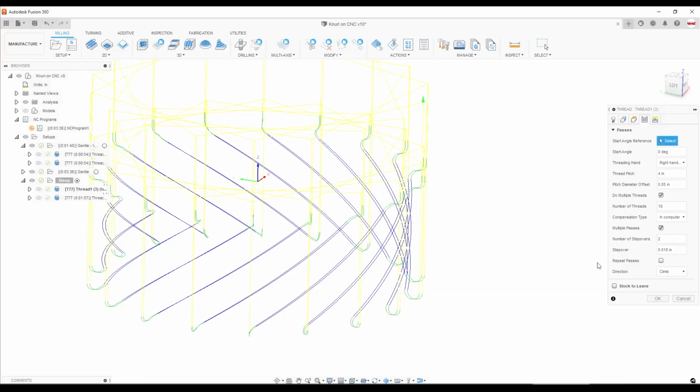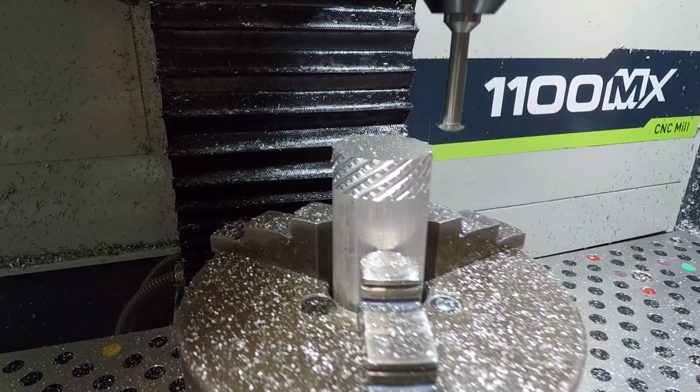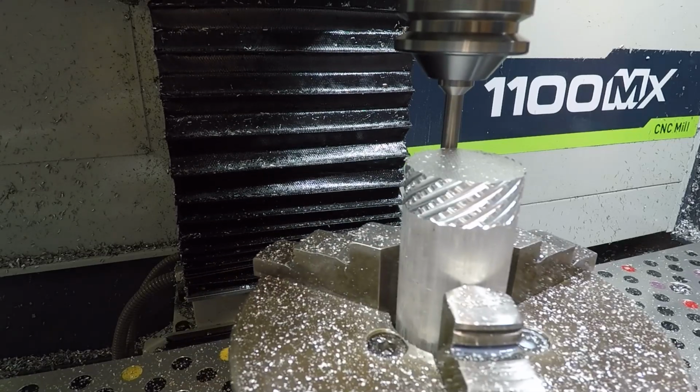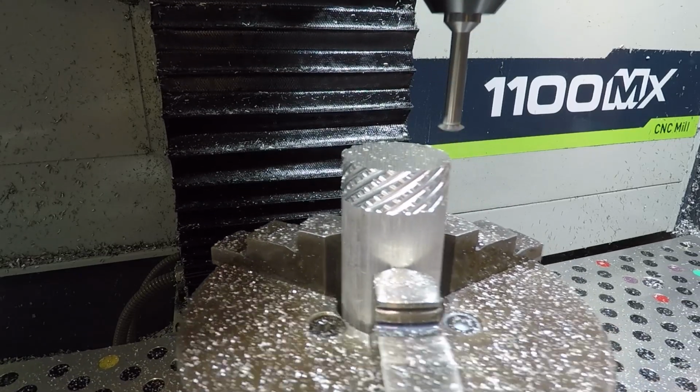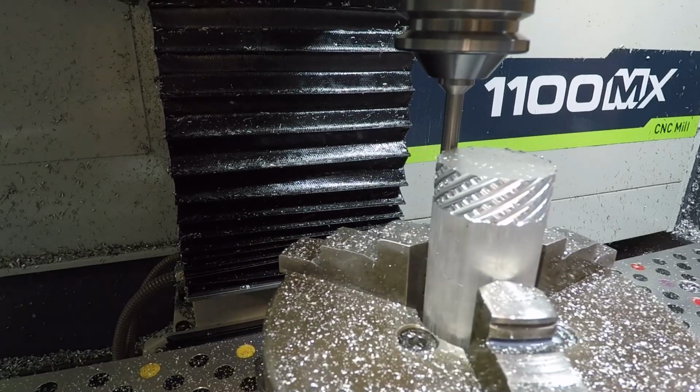And finally, there are a couple of speeds and feeds style settings here in terms of the number of step overs and the depth of those step overs. Those are really going to be specific to the style of cutting tool, the machine, the material, and so forth, but I would encourage you to take it easy, especially if you're new to using this style of tool. The nature of it being a triangle means every time you're increasing the depth of cut a little bit, you're cutting more along that triangle, so you're actually increasing the tool pressure quite a bit. So take it easy, especially when these often tend to be more expensive tools than your average end mill.